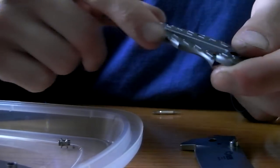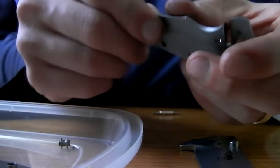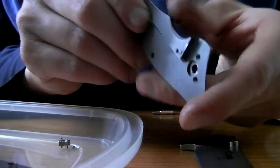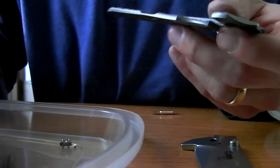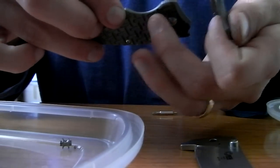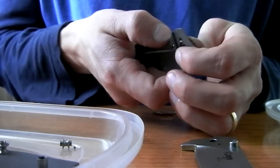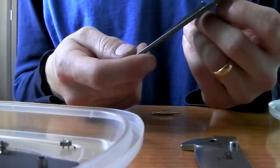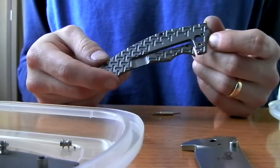Entire outside of the handle is corner rounded with a pretty big rounder, like an 098 or, I mean, 093, I don't know. Whereas the inside is chamfered with a 45 degree whatever to get access in there, and it works quite well. The handles do match up. Like this side is not cut out deeper than the other side. So it leaves a little bit of tight access to get in there, but it's good enough. Again, overall this knife is amazing. I truly, truly admire what he has done.